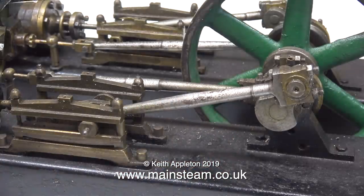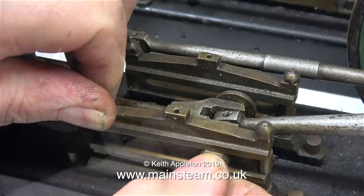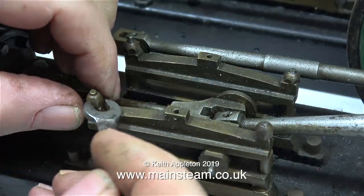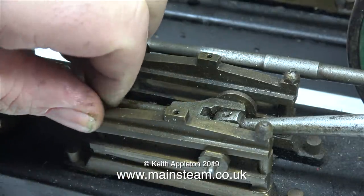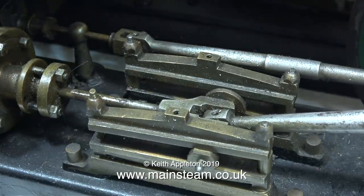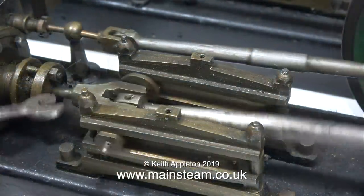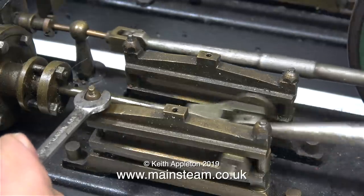There's quite a lot of play in the big end brasses, not too much play in the small end, but there's play in everything around the small end. Just as an experiment, I will adjust the position of the crosshead guides to make them a little bit tighter fit on the crosshead itself. This nut is on a stud that must be bolted in from underneath because it's just spinning free. The mounting base for this engine is made from quite thin sheet metal and is not of the same vintage as the parts sitting upon it. The two U-section pieces of sheet metal have been welded together with a couple of pieces of tube. I've tightened up the crosshead as much as I dare, continuing to do so with the engine running so I know when it starts to get too tight because the tone of the engine will change.